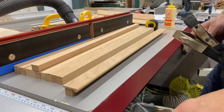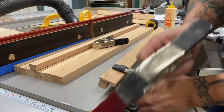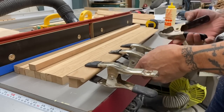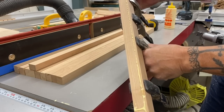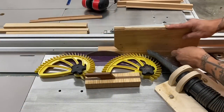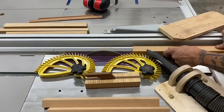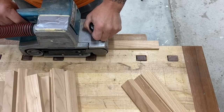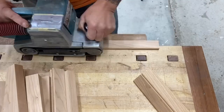I'm the kind of guy who wears a belt and suspenders, so I'm going ahead and adding some clamps. The pins hold it in place; the clamps will make the joint tight. I'll get two of these done and put them face-to-face so each one acts as its own caul, and you get better, more consistent clamping pressure. I thought I'd make quick work of cleaning up the glue and flushing up the back of the handles with the back of the drawer front at the table saw. I love these Hedgehog featherboards, and sometimes I use this magnetic block just to lock them in place. Being aware of the tipping point front and back on this belt sander gives me consistent results.